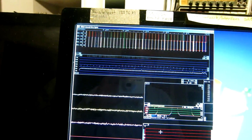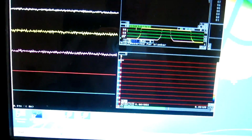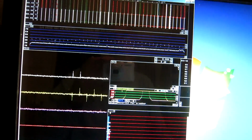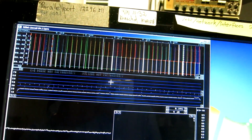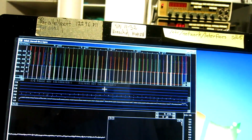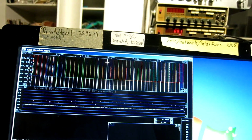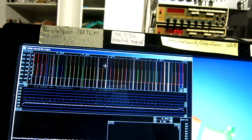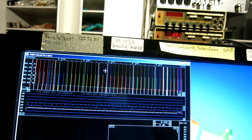Now in Linrad, I can bring down this red bar here, and now you can see at this point, this, which is the strongest signal, gets red. It means it's routed outside the blanker. When it gets red, it is not keyed with the pulses, so the keying sidebands disappear. This signal here and this signal here, which were false signals, are no longer present.